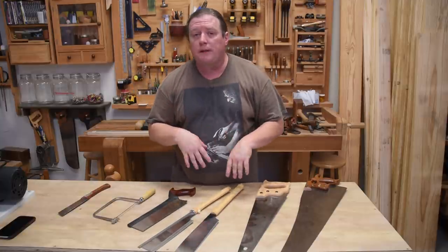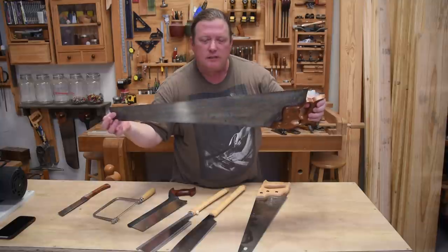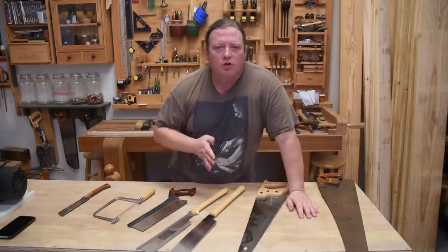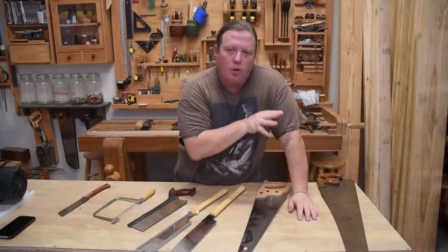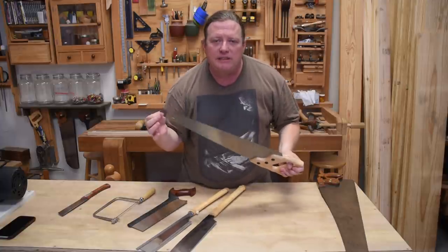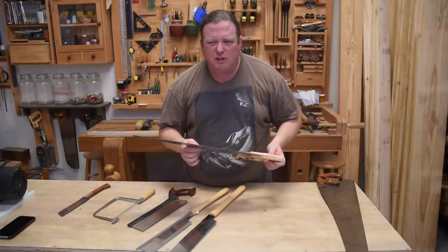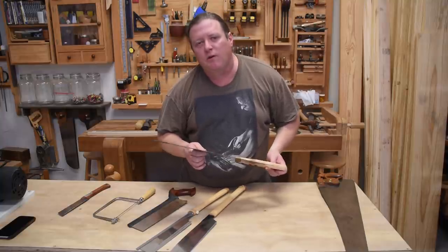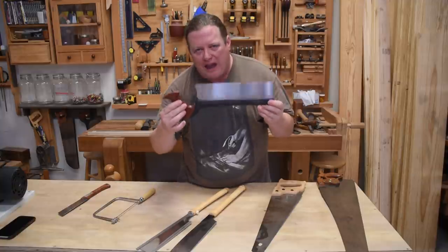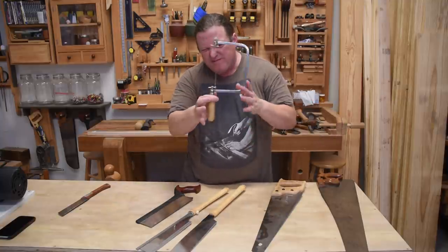What kind of hand tool saws would be nice in an entry-level shop? I don't think you'll need a very coarse hand saw, because for the most part you'll have some kind of power tool to do the brunt work of turning long boards into thinner boards. But it would be nice to have a panel saw in a crosscut configuration to help break down materials, since cutting long stuff into smaller sections can be clunky with certain power tools when you're just starting out. It would also be nice to have a back saw for more accurate cuts, and if you like decorative little curves a coping saw would be fun.